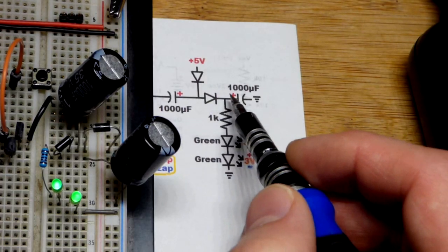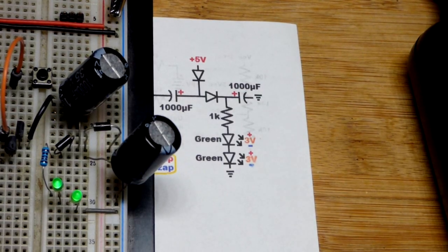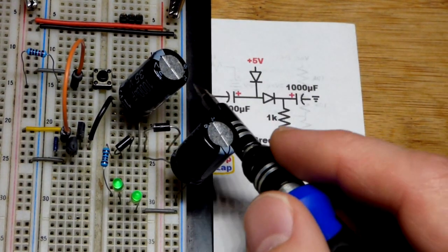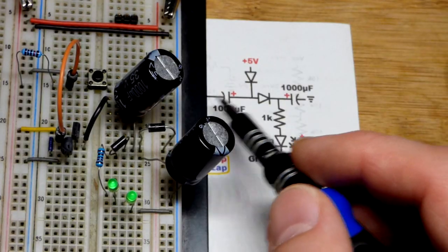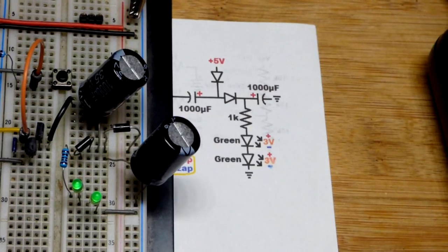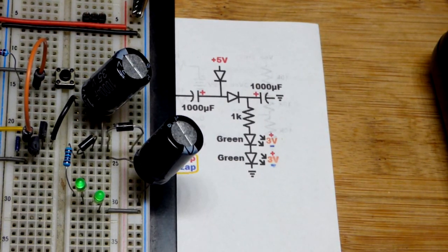We start off with these two diodes — they're limiting voltage. But we have the other capacitor right there so it can charge. It's called a charge pump. It charges when you connect to ground, then you put a positive supply behind it. That puts the two power supplies in series and they force current into that capacitor, so its voltage will rise. But the load is going to take current away.